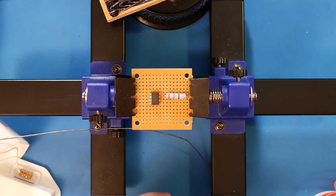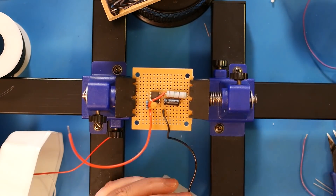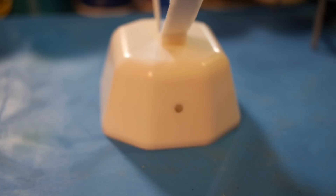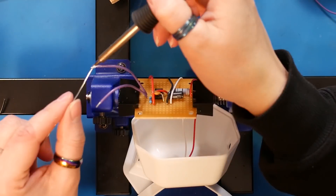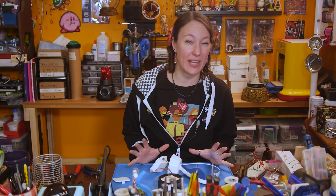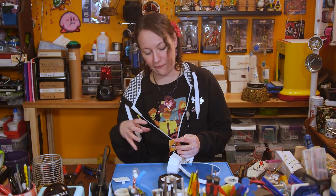Thankfully the 555 circuit is pretty compact, so I can easily fit everything on here. I'll have wires for power and ground, with ground running to the switch and power to the battery pack. The red wire of the LEDs will run to pin 3 with the original resistor I moved onto the perfboard, and the white wire of the LEDs gets connected to ground. Conveniently, there's already a small hole in the side of the heart case — perfect, because I wanted the thermistor on the outside so I can do my lighter and ice pack trick to quickly change the temperature. The thermistor needs to be soldered to wires so it can be stuck through that hole; I need to make sure the leads won't short, so I trim them down and solder shielded wire to them. After testing with my desktop power supply, I decided the 2.2 microfarad capacitor was a little faster heartbeat than I wanted, so I switched back to the 4.7 microfarad capacitor, bending it over to keep a low clearance so it fits in nicely.